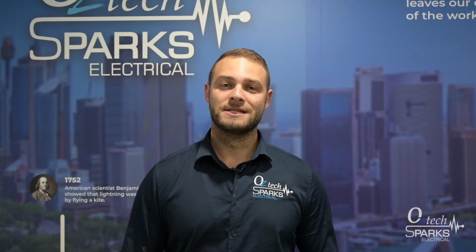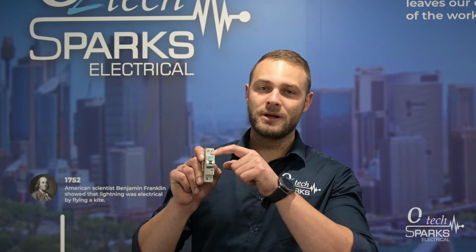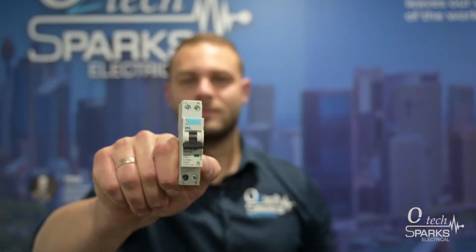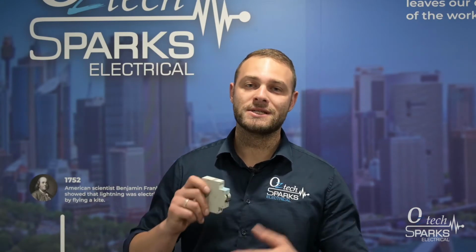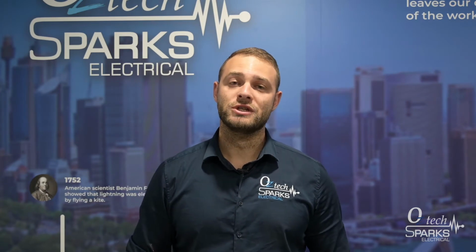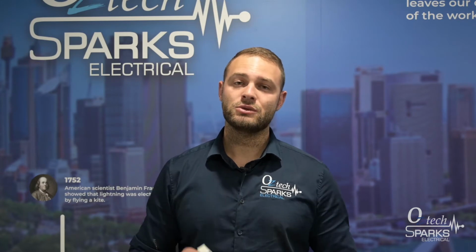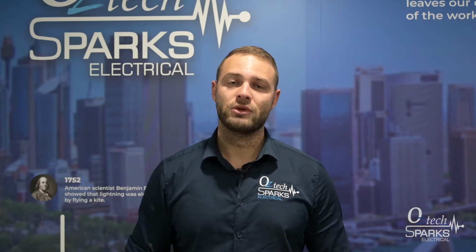Safety switches should be tested every 6 months. And when you look at a safety switch, it has a T push button on the top of it. Pushing that test button will trip the safety switch straight away, and that just ensures that the internal mechanisms of the unit are always staying operational. It's important that a licensed electrician does a regular safety switch check. We bring out a unit and we plug it into the RCD or the safety switch, and we want to measure the trip rate of the RCD, ensuring that it stays under 0.3 of a second.